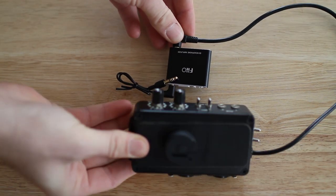Another interesting application would be to add it to something like this little XLR to eighth inch adapter. You put this on, and now you have controllable gain from what was otherwise a passive device. That way if the microphones coming in are a little bit quiet, you can use the gain here instead of the gain in the camera, which is a little bit more noisy. This also gets you kind of up to the level of almost a Juicelink device where you have gain in your XLR adapter.